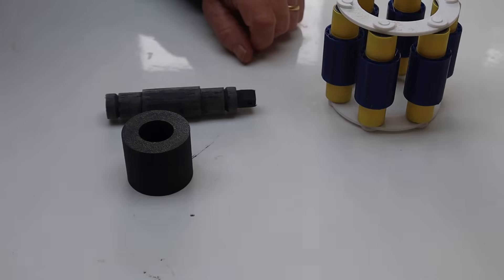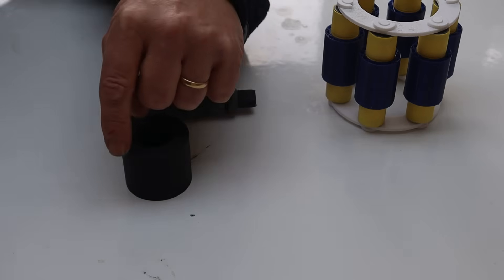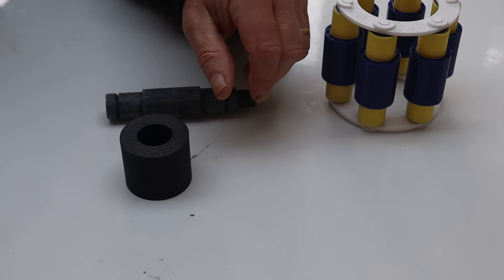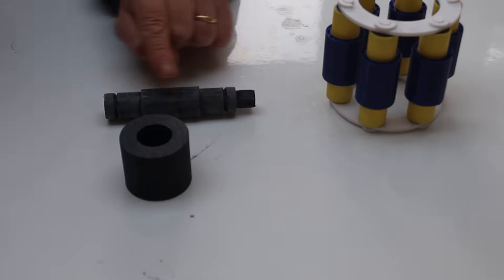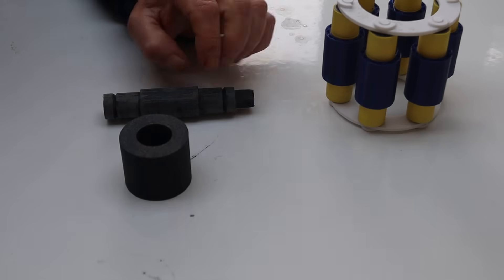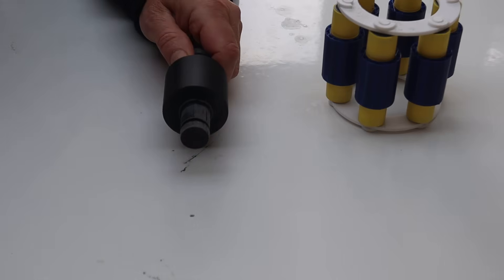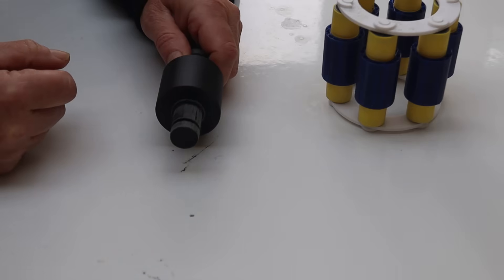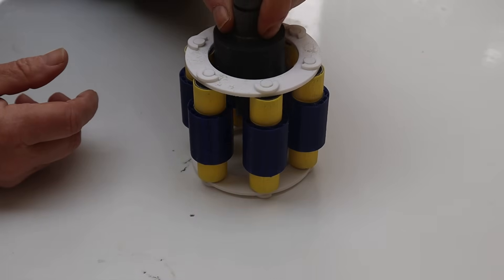These two parts are the driving sun. It's split in two parts because one part is printed in one direction with a staggered seam, which means it'll press nicely against our rollers, and the other part is printed in the perpendicular direction so it'll have strength when we try to turn it. The driving sun gets pushed on so that it's roughly two millimeters away from the little step, held in place with glue, and then that whole thing gets put into the roller cage.